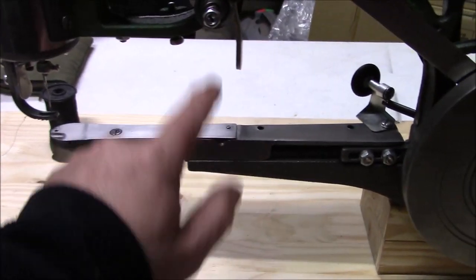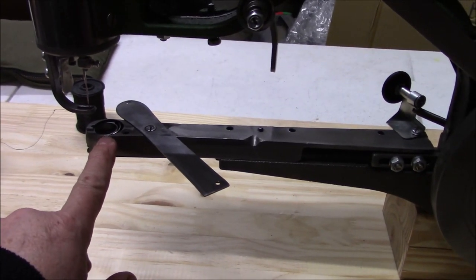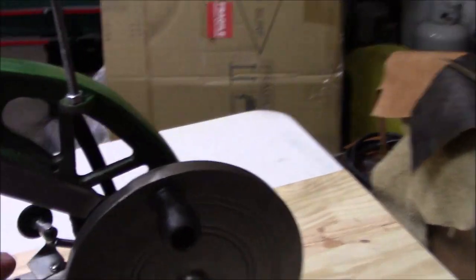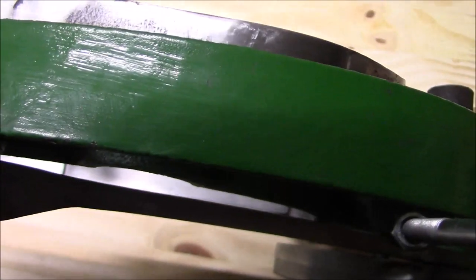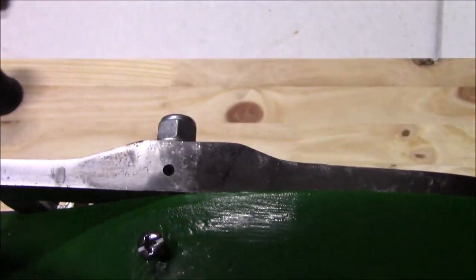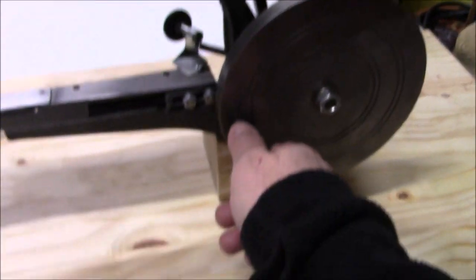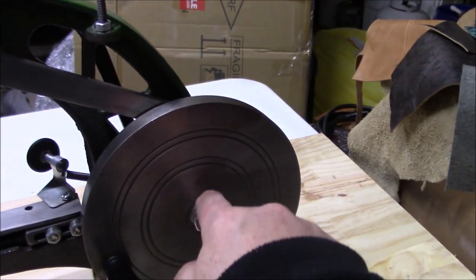I made that groove a little deeper too, but I figured out an easier solution: instead of pushing the plate that direction, just pull it towards you — and you never have to cross over where the thread would possibly break. I also put washers here and there; this piece was right up against the frame, so I put a washer there to reduce friction. I may also put one between this piece and the frame.